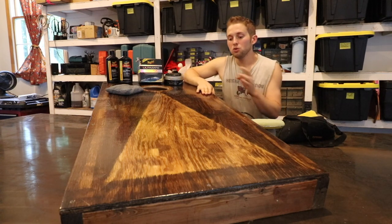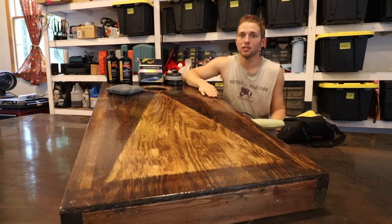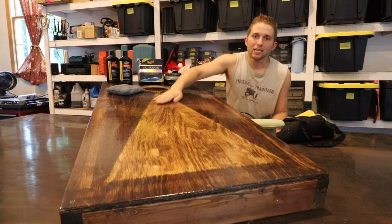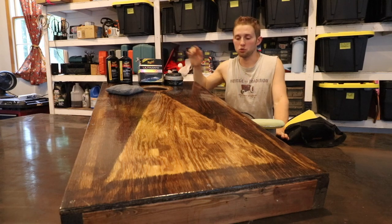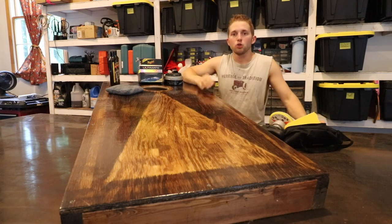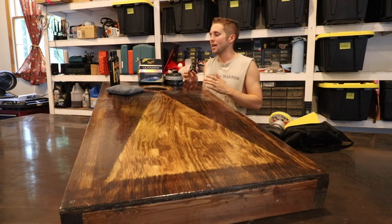Why do we start off with sandpaper? When you do your final coat of polyurethane, it's pretty much impossible to get that coat perfect — there will be little bits of dust and debris that get into your top coat. By using 1500 grit and then 2000 grit sandpaper, we remove a lot of those impurities and high spots. You will notice that after you use the wet sandpaper it will haze up the board a little bit and look dull — don't worry, we will get all those scratch and haze marks out as we go through this process. After wet sanding, clean off the board and remove all that dust.